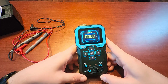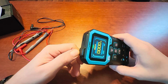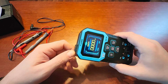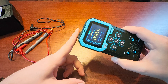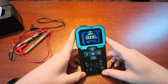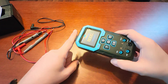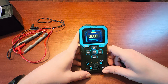Why did I get this particular one? Reason number one is EMI detection, which works pretty fine. I'm able to detect stray EMI fields coming from power cables that I'm doing reviews on. If the power cable is shielded properly, the device will be quiet and won't find any stray EMI. But if there are problems with the shielding, I'll be able to detect the current inside. It works both ways — if the shielding is bad and I can detect current, it means EMI can also enter the cable. If I can't detect any live current, the shielding is good enough to protect the wires from stray EMI and RFI.